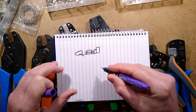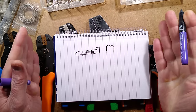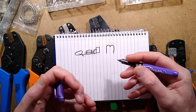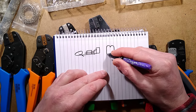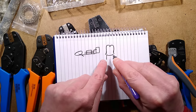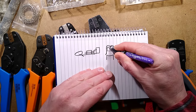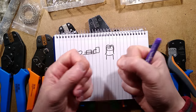When you crimp this, the crimping tool has something that looks like the McDonald's golden arch at the top. This has to be made to good quality — it's not something you can just bang out with a standard milling machine; it tends to be done by specialist processes like spark erosion. The other side is a slight cup shape. When you push the crimp up against those arches, it curls the wings around onto the wire or insulation. Over-crushing can damage the wire; under-crushing won't grip it properly.